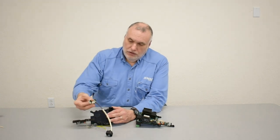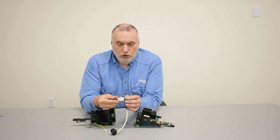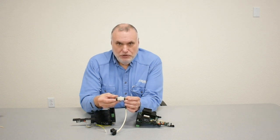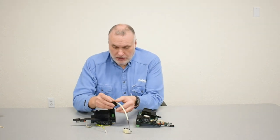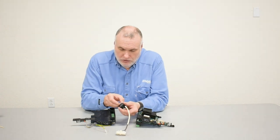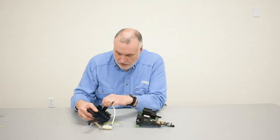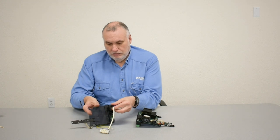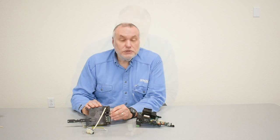This would be a typical limit switch for lifting and lowering. There are micro switches that get actuated by blocks on the chain, either the bottom block or the anchor block at the end of the chain. This end feeds back up and plugs in so that the plug — being small, flat, and rectangular — fits in the upper socket on this square plug-in point, and then the square grommet covers it and protects it.